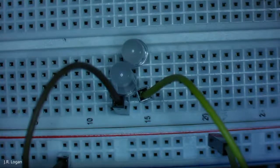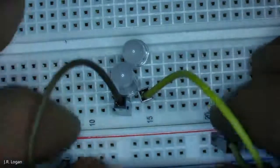But that's breadboards. Breadboards are really picky because you have all these little pins being held on by all these little clips. So if you want something to work on the back of your bike, attached and lighting something up, you don't want to use a breadboard. As soon as water hits the breadboard, or any movement, there are all these wires to catch things on. Breadboards don't last long. They're great for your initial prototyping.